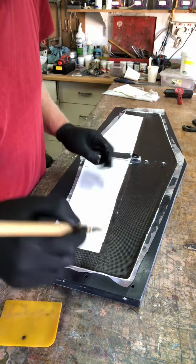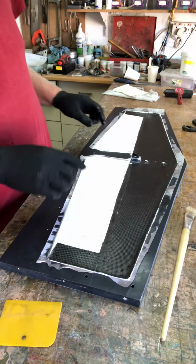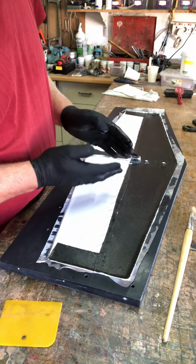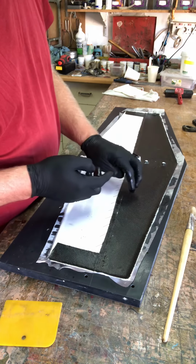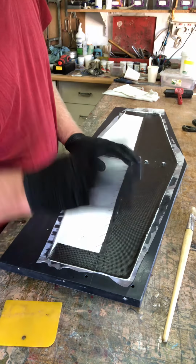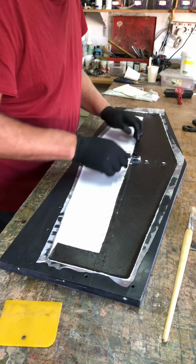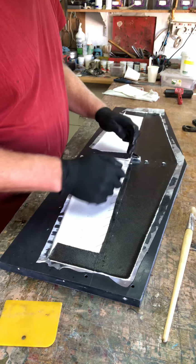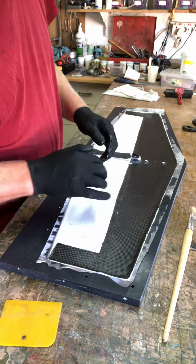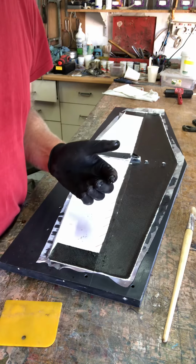Now obviously I'm going to put the Airex down next, and then I'm also going to then put another layer of glass. So the peel ply is actually encapsulated between two layers of glass theoretically. The 25 on the outside and the 49 on the inside. So my hinge line will be cut or sanded through up to the peel ply, and that will create the actual hinge, which I've shown you before in another video. Right, we'll get on with the laying up of the inner skin now.